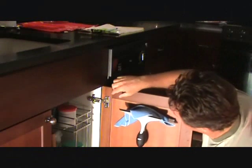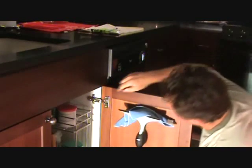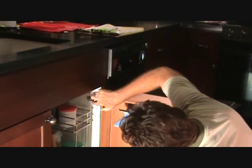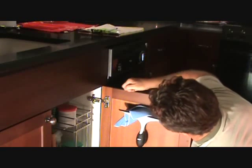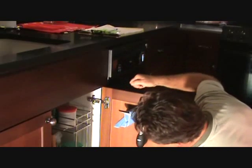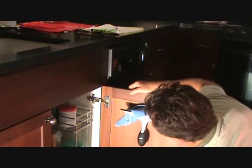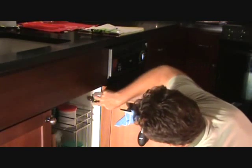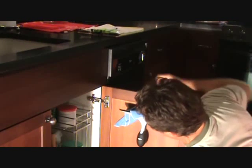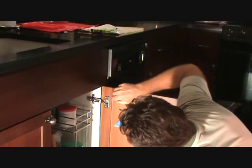This style of cabinet door has recessed hinges, and if you notice there are some screws here that attach the hinge onto the cabinet. There's enough slop there so if you loosen up those screws you can push the cabinet door up or down. You've got to do both sets of hinges. This one here is loose and that could be the reason why it's sticking. So we're going to line this up, tighten everything down, and see what we've got. There are some other adjustments here but those are for something else — for this portion we're just going to be interested in the top and bottom screws.